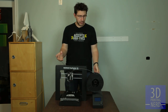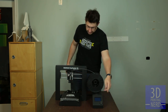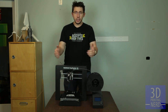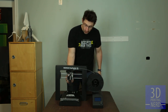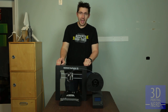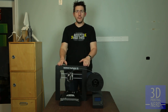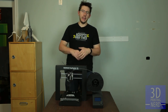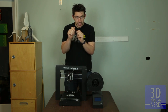First off, let me tell you about the printer. The control box is right here, and this knob on the front selects settings from the LCD here. The printer has a nice steel frame. The build area is 8 inches by 8 inches by 7 inches tall. It's got a 0.4 millimeter extruder right here, and it'll spit out 1.75 millimeter filament through an MK10 nozzle. It'll print any filament you throw at it — nylon, semi-flex, ninja-flex, ABS — you could probably melt car tires down and send it through there if you could get it tiny enough.